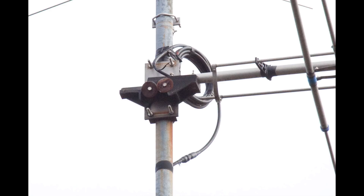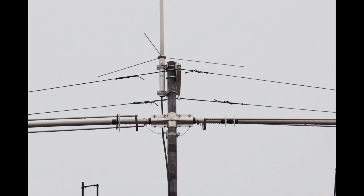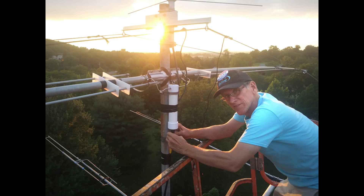But last year the plastic insulator in the center broke and since KLM no longer existed I couldn't replace it. Thankfully, in talking to MFJ they suggested I use their high gain center insulator, which they use on their two inch boom for their large tri-banders. Since my mast was two inches and my old tubing for the antenna element was an inch and a quarter in outside diameter, it just worked perfectly. I was so impressed with the strength of that installation compared to the plastic insulator that had broken. So I was back in business with the antenna I really liked.